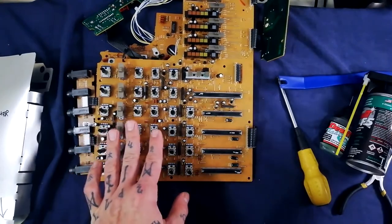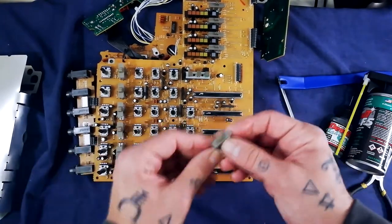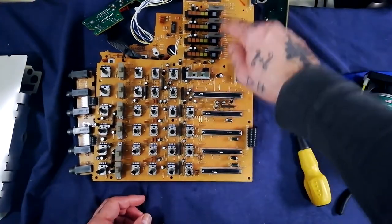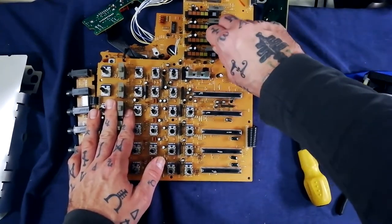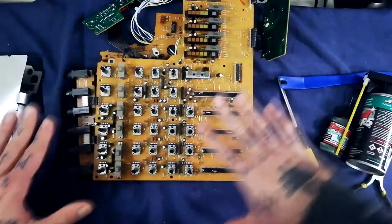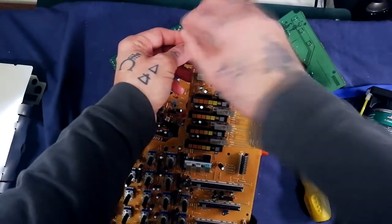The shielding comes off the front. You can get in here to clean it — check the cleaning section playlist on my YouTube channel for detail. Note that the various knob caps need to come off to effectively clean those switches. Also note they're not all the same size — these thinner ones for the track arm can be mixed up with the thicker ones. If you put them in the wrong place, the plastic case won't go back on, so watch out for that.